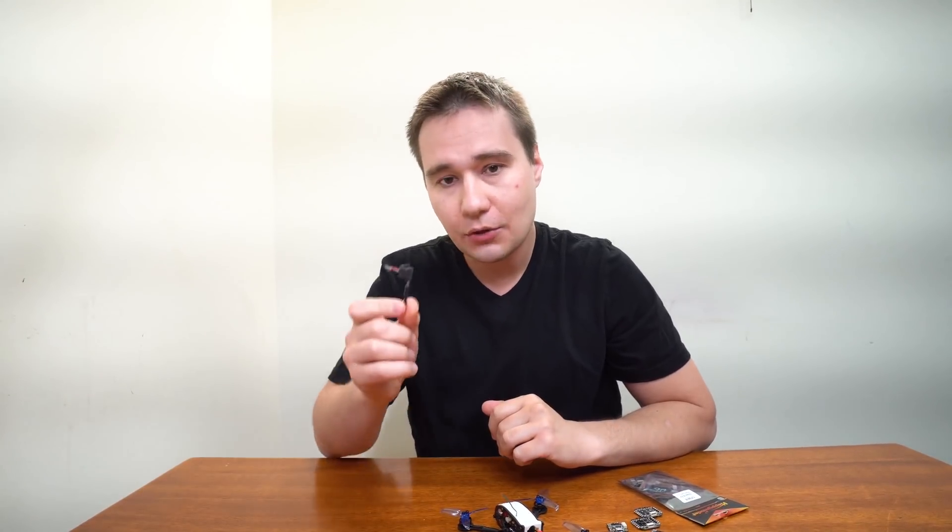Another component I tried first was the VM275, which is a nice little video transmitter, but the video signal wasn't as clear as I'd like. I decided to fall back to the Runcam TX200, which I really love and think is underappreciated. The video signal is just so nice, especially when you have something to compare it to. It's almost as light as the VM275 and another benefit is it doesn't have a voltage regulator on it, which makes it much easier to use with 1S builds — extra voltage regulators can overload the system and cause brownouts, which you really don't want on 1S.